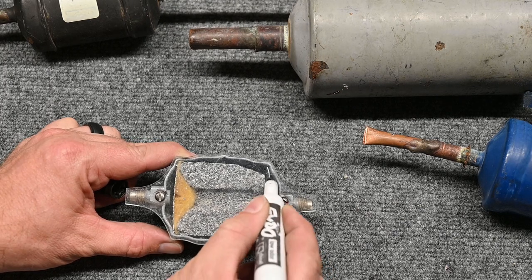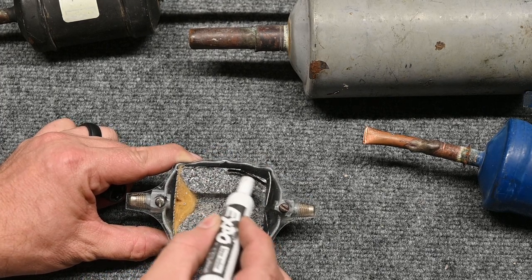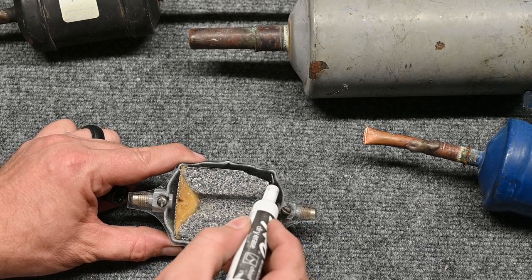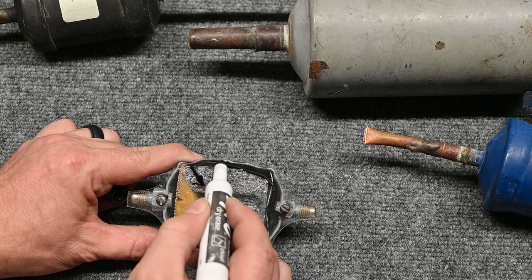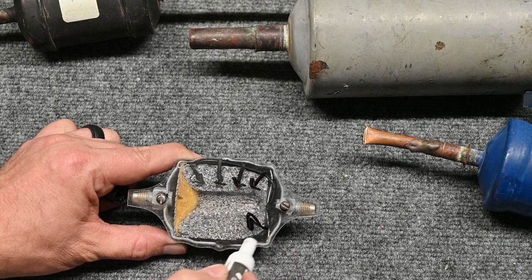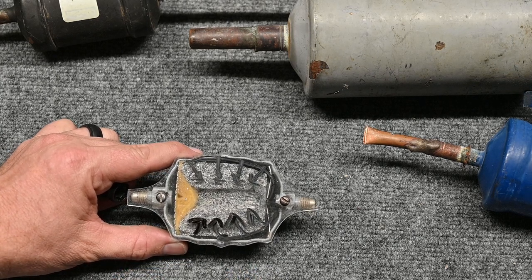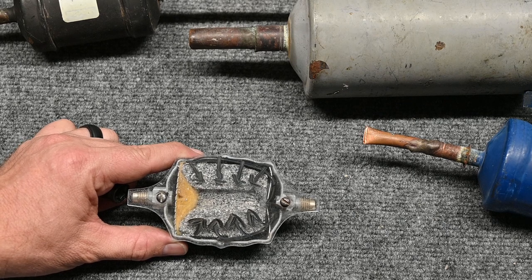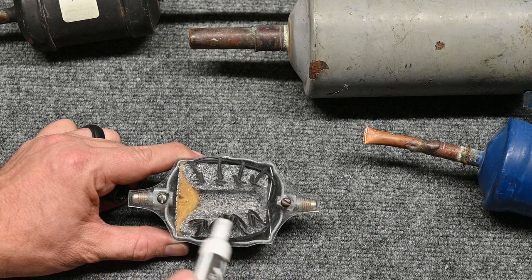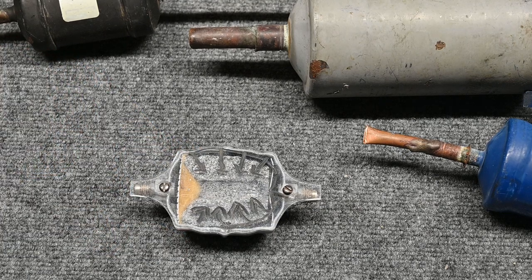Let's look at how this is designed to work. Our refrigerant comes in and it hits this plate, which is designed to divert the refrigerant around the very outside. This filter dryer has a little bit of an angle on it — that angle allows the refrigerant to flow around it. So the refrigerant comes all the way outside and has to go through this desiccant material, which dries it — in other words, it's pulling out H2O. Now when I say dry, don't get H2O and any liquid mixed up. A lot of students do that. Liquid refrigerant is flowing through here — it's not stopping at all. It's only pulling out the H2O.